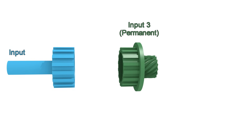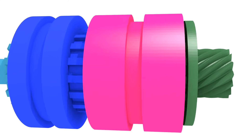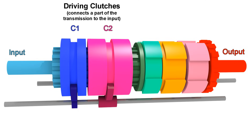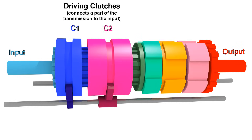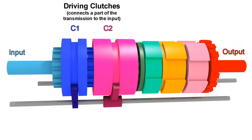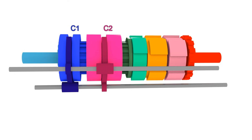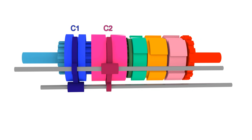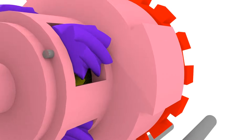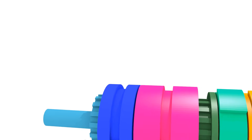The rotation will transfer by these sliders that can move back and forward, but will always rotate together with the input. I made these 2 sliders to connect a part of the transmission to the input. So if C1 is engaged, this entire piece will rotate with the input. And if C2 is engaged, this other piece will be connected to the input. We can connect C1 and C2 independently from each other. On a real transmission these 2 clutches are not like this — I made these sliders so it's practical to use on a 3D printed model, but the function is the same: connect a part of the transmission to the input. I will put a link in the description to a video explaining how the real clutches work. But for now, let's go through how we get all 6 speeds.